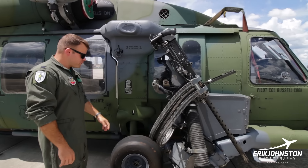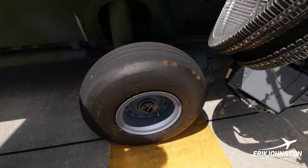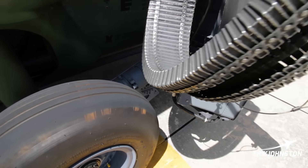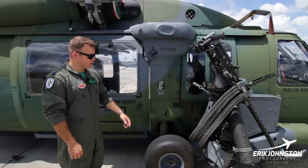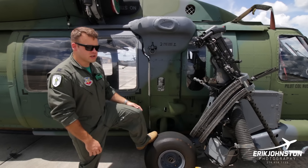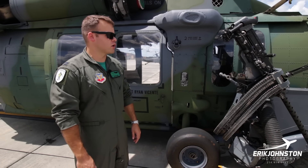On the side of the aircraft here we've got the main landing gear — it's a wheel with a strut. The cool thing about the 60 overall: the Blackhawk program was started in 1972, and the Blackhawk was the first U.S. Army helicopter designed for crash worthiness. These landing gear are one of those design aspects. The struts allow us to land on rough or uneven terrain like a suspension, but they also absorb a lot of energy if we ever put the aircraft down in a crash.